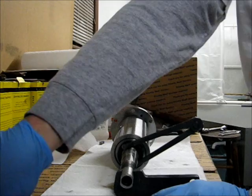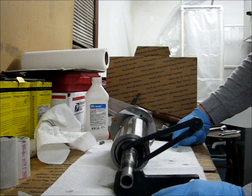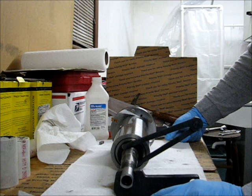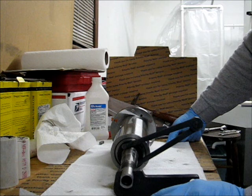I was using one of these fancy gizmos here, the non-contact pyrometer. I measured it inside the nose, and I also verified by loading a tool, in this case the Superfly cutter, since it has a black finish, so it's a little less reflective, so the non-contact pyrometer gets a better reading off of it than a shiny surface. Verified that it was staying between 105 and 110 degrees after running it for about 10 minutes at that speed. That's not cutting at all.